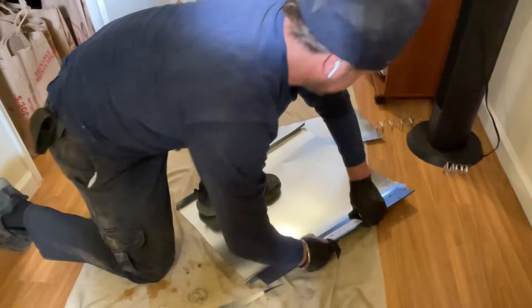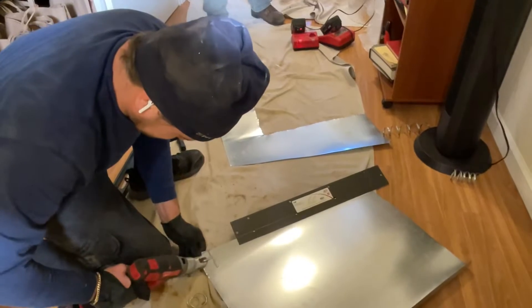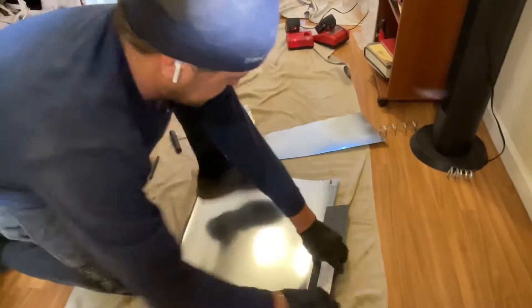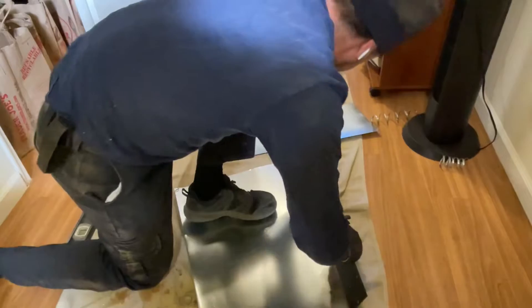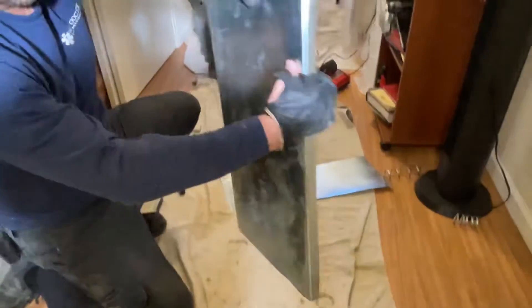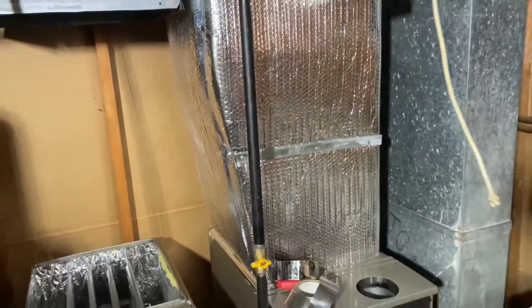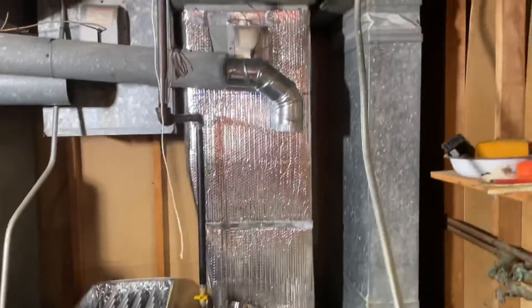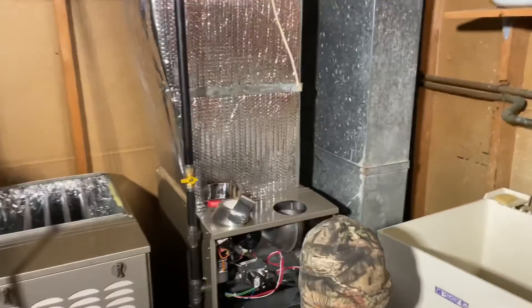I'll have to cut that bit too, but I have to do that right now before it gets too hard. And there you have it — that's the front of the furnace. The plenum for the first floor furnace is done, even insulated it. Made a little offset there, as you can see. And now we're working on the four-inch flue pipe for the exhaust. The gas is done, we're going to do the wiring and thermostat, and we'll fire it up.